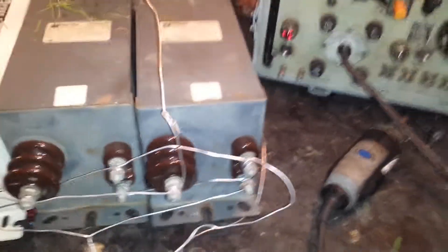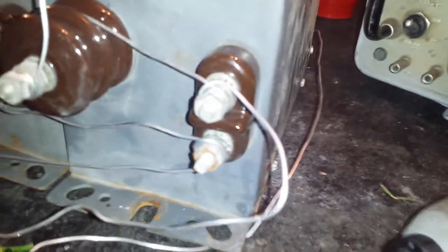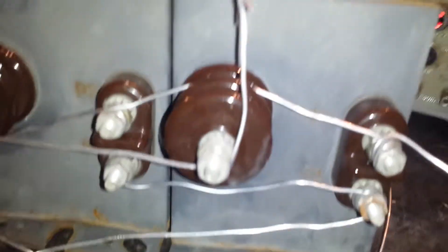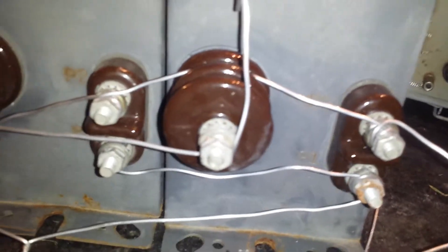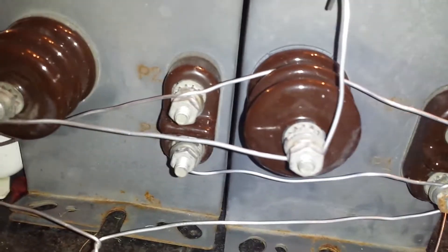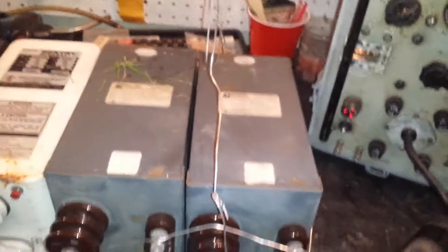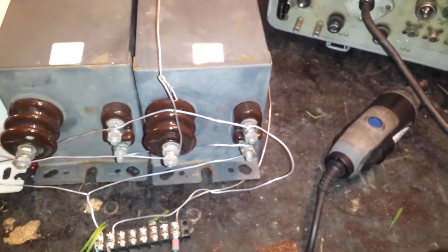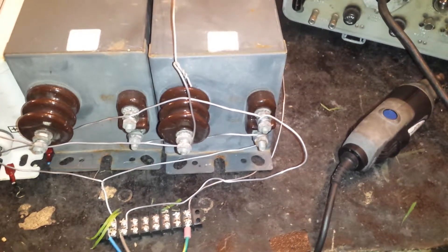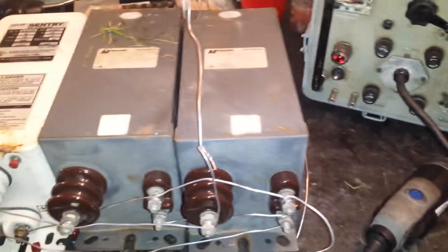These basically have primary windings and secondary windings inside. Your primary windings are 120 volts — that's what that is. The secondary winding is that big one right there — that's 12,000 volts, 30 milliamps. I can't remember how many turns there are, but there are quite a few turns for high voltage. Tar insulated, not oil insulated — wish it was oil. And then you get your 120 volts transforming into 12,000. Pretty simple how it works, not much to it, and there's no fail-safes in there. It's pretty much pure power, no circuit boards involved, and really not much for water to get into.